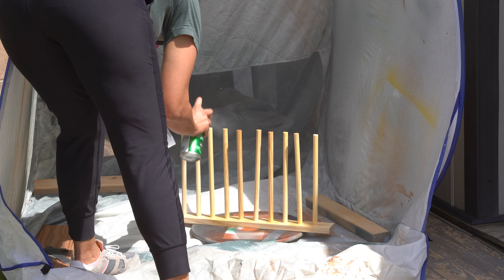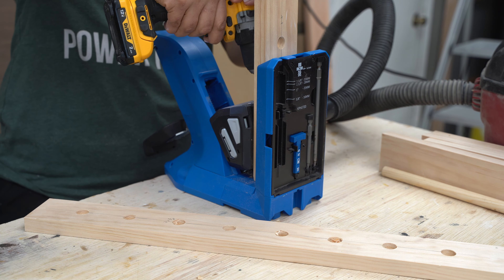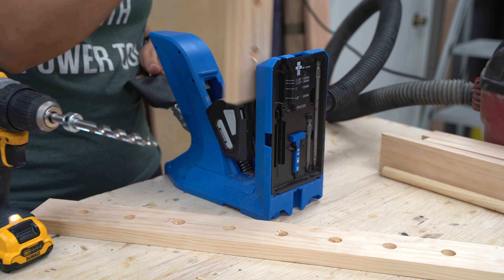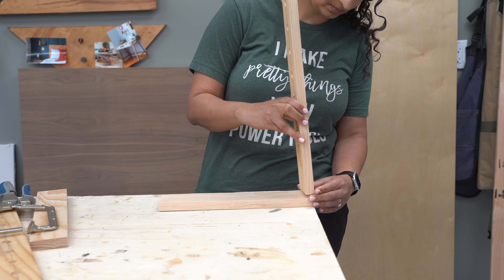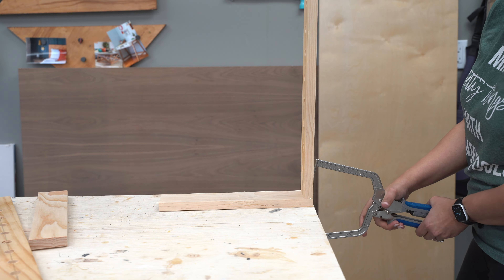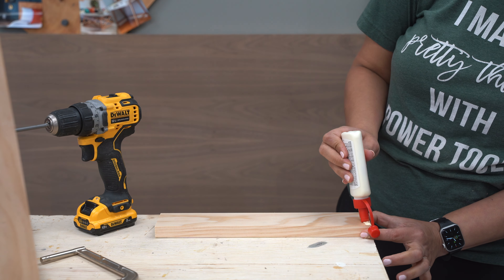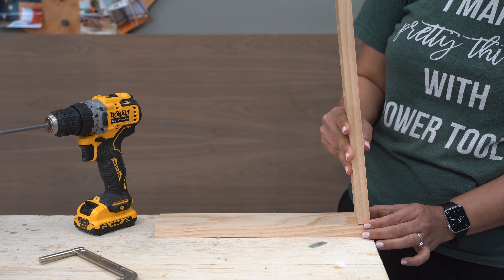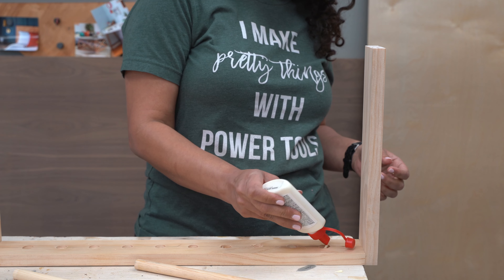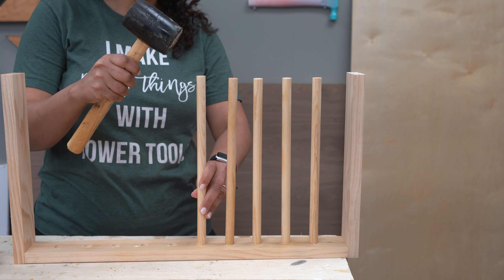This is essentially a spray form of the Spar Urethane. Now it's time to build the drying rack insert. This is pretty much like building any drawer, except that instead of the bottom of the drawer, we will be adding in those dowel rods. I am using pocket holes to build the drawers — if you need a detailed tutorial on how to build drawers, I have a full video on exactly that, and I will add a link in the description below. Once I had the three sides attached, I added all of the dowels into place.